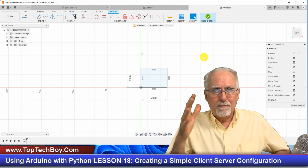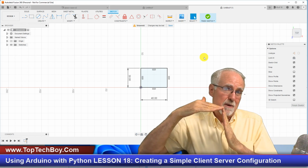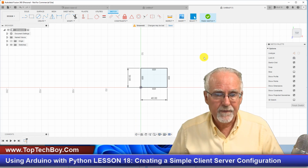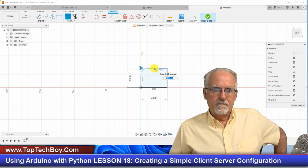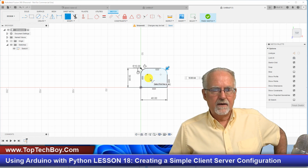Now, this box that I've shown, do you want your box to have a very sharp, hard corner that might cut someone's thumb, might cause an injury, product liability? No, I want to round that off nicely. And so what I am going to do to round that off, my friend, is the fillet. So I'm going to say, give me this and give me this and give me a fillet. Give me this and give me this and give me a fillet. I see that I'm getting warnings over there as I do this, but if I look, I'm not fully constrained, but I'll not panic yet until I get this finished.